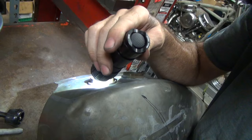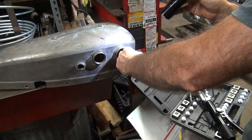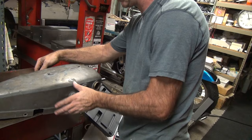See the top of the hose. Can you see in there? I don't think YouTube can, but I can. See, there's the back pipe right there, and you can almost see the top of it. And the front one on there. And then you can see all the way down in there. Can't feel the front, but it's got clearance. I've got about a quarter to 5/16 clearance on everything up inside there. So it's just perfect.